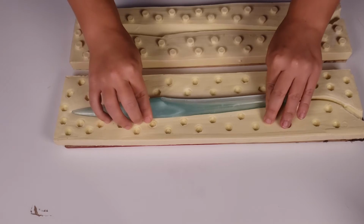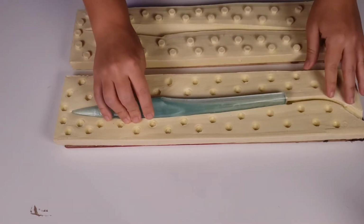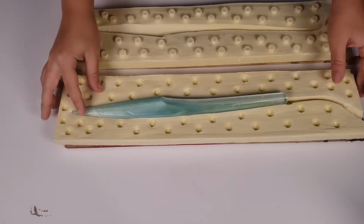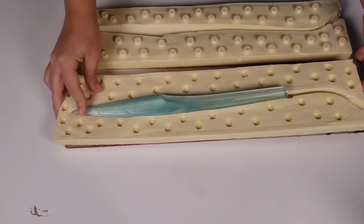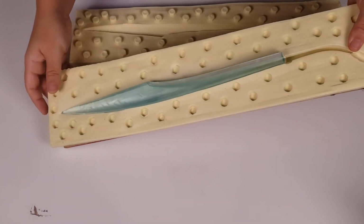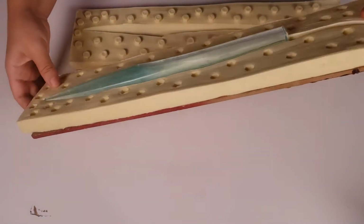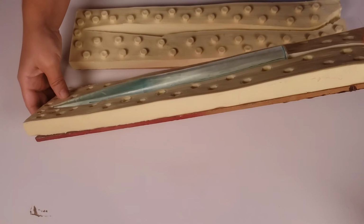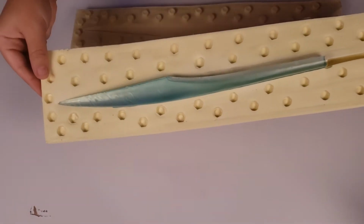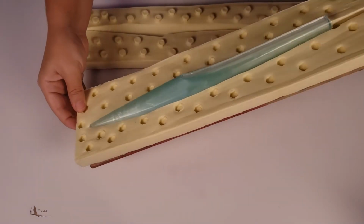it didn't really make sense at the time to invest in a pressure pot because they were too big to fit in one anyways. So I tried to come up with different techniques to get as few bubbles as possible, which is mostly just how you tilt the mold and how you slowly pour it in to prevent as many bubbles as possible.